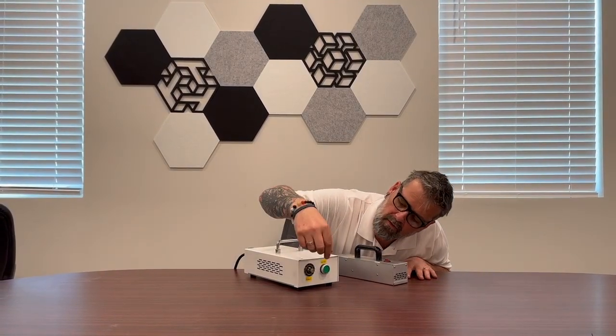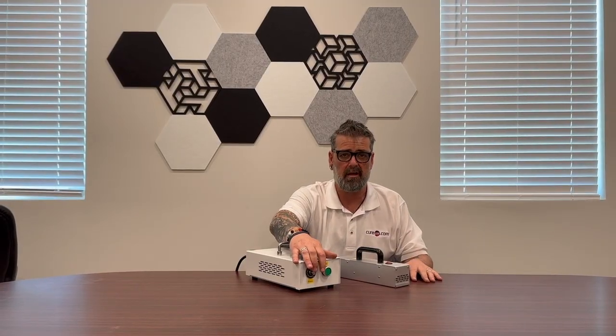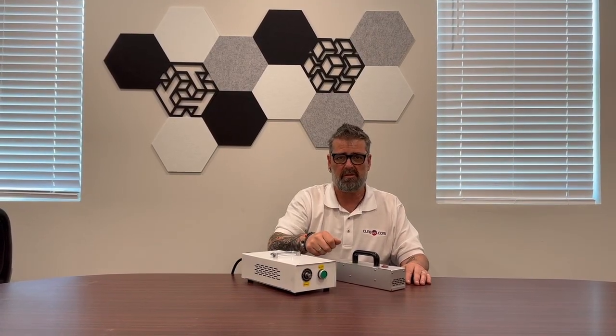They have a pot on the front here — these are adjustable from zero to a hundred percent, which is basically infinite adjustability — with a power density of up to two watts per centimeter squared, which is way more than you'll get out of any 110 volt mercury vapor system. That's twice the power density.